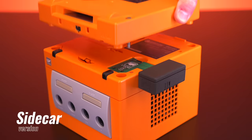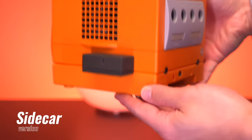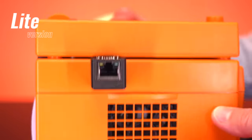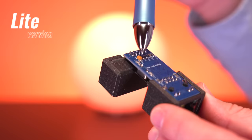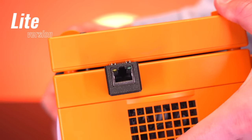The Sidecar version has the added benefit of being compatible with the GameBoy Player. The Lite version can technically also be compatible with the GameBoy Player, but will require some work to trim down the pins and replace the capacitor with a more lower-profile one. Both these kits will be offered as either fully assembled units or as a DIY kit. Do keep in mind that the DIY version will not come with an Ethernet module and you will need to do some light soldering work for the SP2 adapter board.